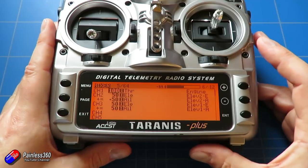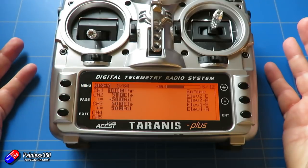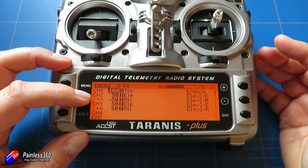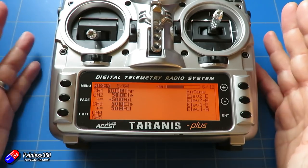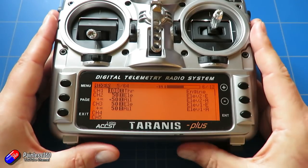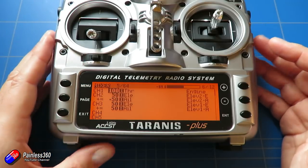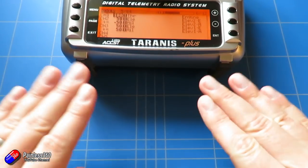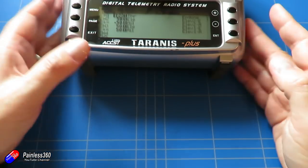If we page through we can now see a really interesting output setup. Channel one is obviously the throttle - that's where we'll plug the ESC in a moment. But channels two and three have both the elevator and the aileron against them, because the radio is mixing those two controls into both servos to control those control surfaces. The elevator is in the same direction on both channels, but the aileron is different because for elevator the surfaces move in tandem and for aileron they move in opposition to give roll.